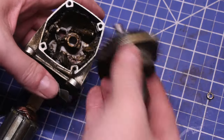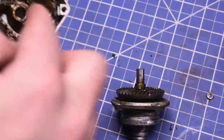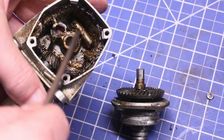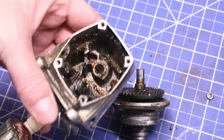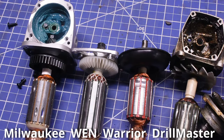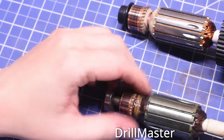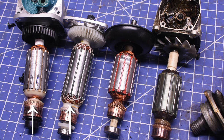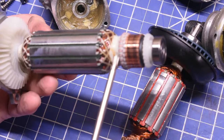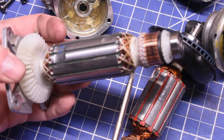The old Drill Master's gear is a bit better than the Warrior's — maybe it's just polished from use — and there's way too much room in the head for grease, which has all but been expelled. And the spindle lock button is still dangling around in the head after all these years. This model even uses a needle bearing — the Milwaukee being the odd one out there. When it comes to the armatures, you can see why the Wen makes the most power and the Warrior the least — it's all in the size. The Warrior has some epoxy on the windings but little, and missing in some places. The Drill Master just sort of globbed it all over. Both the Milwaukee and Wen look very tidy — the Milwaukee's windings are all well epoxied solid, and the Wen has additional white stringers which some feel adds strength but more than anything adds a surface shape that brushes away metal dust better than a smooth one.